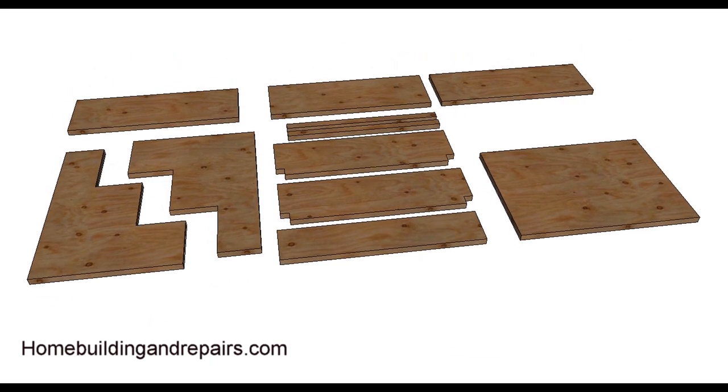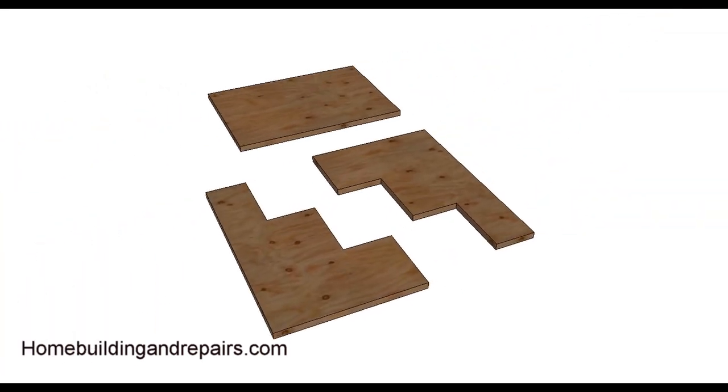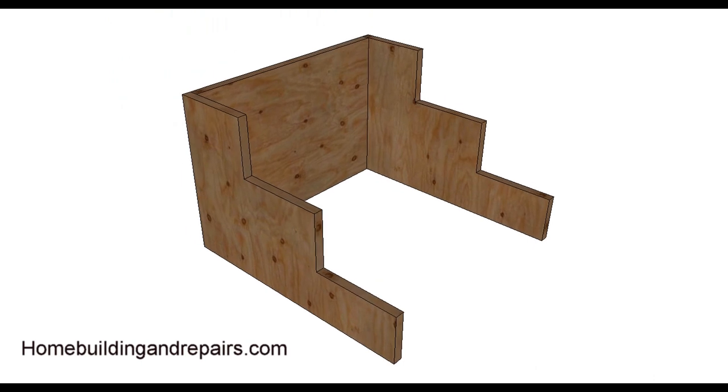I will provide you with measurements at the end of the video. You're going to cut your stairway into pieces: these will be the treads, these the tread supports for the risers, and these will be the second and third riser, the bottom riser, the back, and the sides. Let's start with the two sides in the back and fasten them together. This can actually go on the other side - you would need to change the measurements. A lot of times when building a little stairway for a mobile home or trailer, it looks nicer to look at this side.